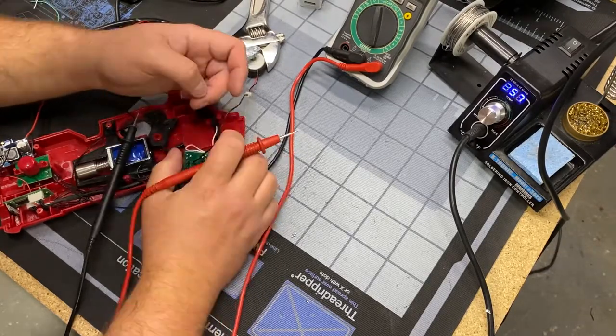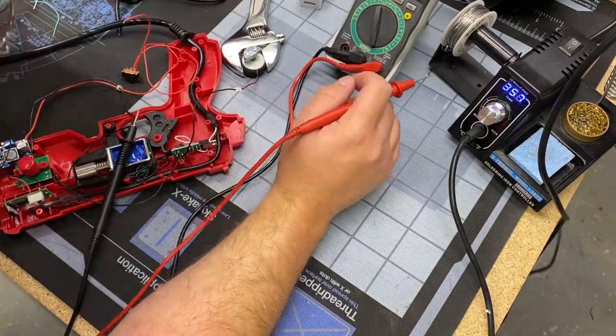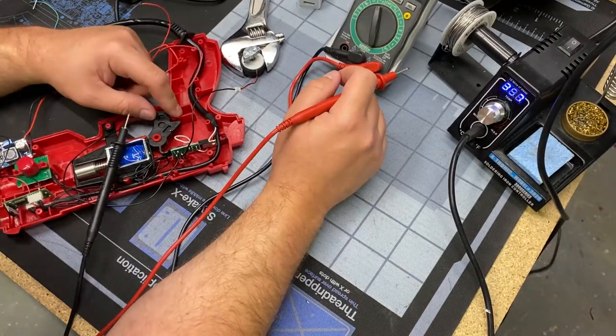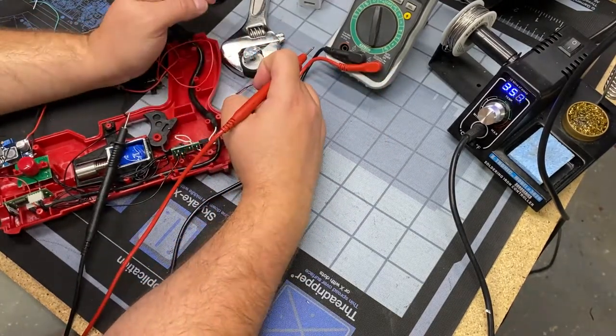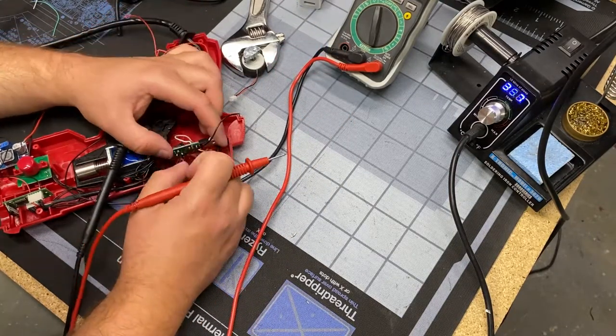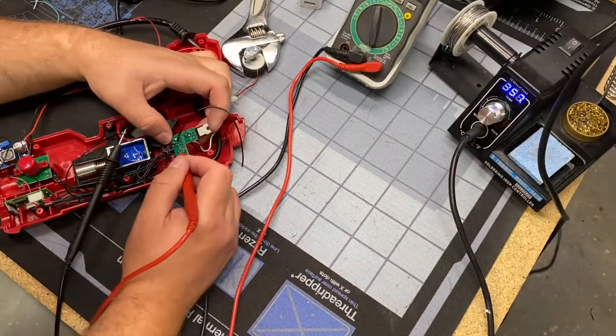I don't remember if I figured it out while I was doing this or if I kind of slept on it. But basically, because I pulled power from USB, that switch is breaking ground on my power source, so I'm creating a ground loop. I'm pulling ground from that switch, and I'm also pulling ground over on the left from the USB at the same time, so I'm not interrupting anything.